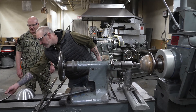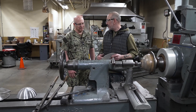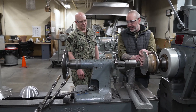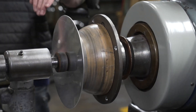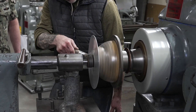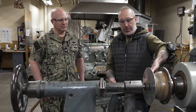So we're going to start off with a flat plate. Our dies — a lot of them have a centering pin on it so we don't struggle to find the center. We put it on our centering pin, bring our tail stock in. Our next step is going to be putting some stick wax on the material itself so that the roller slides nicely. It's a constant stretch and relax of the material until we get it formed over the die itself.